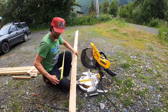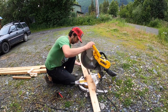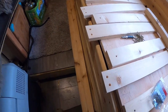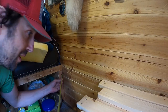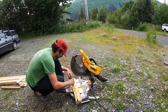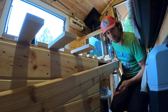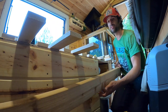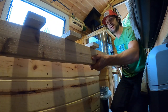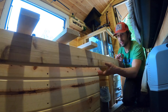Now we get to build the actual frame of the bed. We've got our 2x4 cedar piece already cut. I'm measuring how big to cut the support board the frame will sit on, and we have a little cedar support board cut for the wall. To figure out how tall to make the leg that supports the cross beam, I'll pull out some of the moving slats, lift the cross beam until it hits the slats and slightly pushes up on them — about 17 and a half inches.